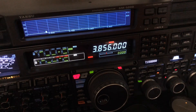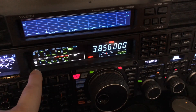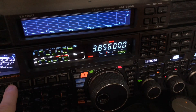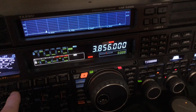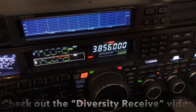I have an antenna switch within arm's reach, so without dual receive I can just quickly switch over to the other antenna. But with dual receive and multiple antenna ports, you can assign — like in this radio — VFO B right here. Antenna selection: I could assign VFO B to port 2, 3, or 4 in the back of the radio. So if I'm going to use two separate antennas, I would want to do something like that. There's a whole video about diversity receive, but I'm just giving it an honorable mention since I'm talking about dual receive.